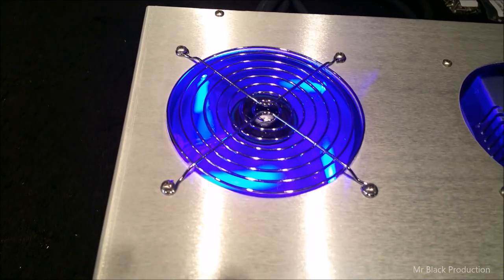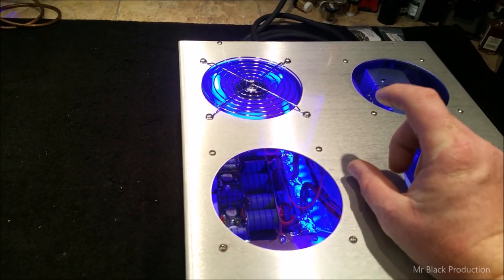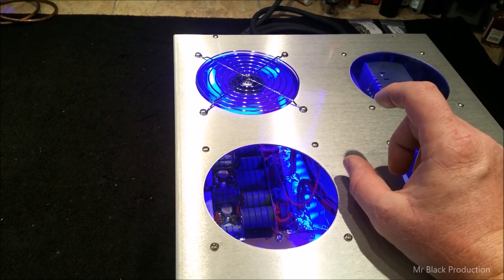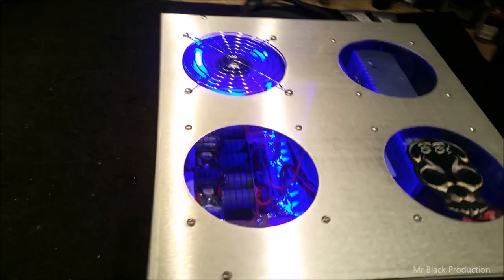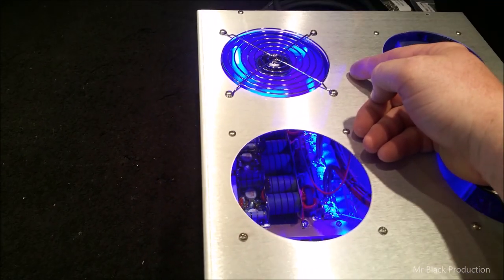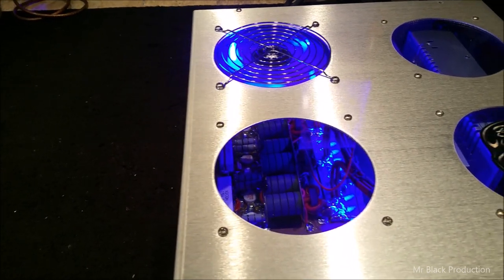They're super quiet. They make them in all colors. They've got a high CFM flow, and in that MOSFET box, I've got these big, thick, high flow fans. I like this thick. These Corsairs are about that thick. Those in the MOSFET box make about 101 or 105 CFM worth of airflow. It's almost twice the amount of air movement, but it shows because of the noise. It's in a mobile unit, going to be sitting way back in the back of somebody's seat. But this guy is going to be talking on a radio next to it. So everything that comes out of here from this day forward is going to have the high flow Corsair fans in it. I feel they're a better product, and that's the direction we're going to go.